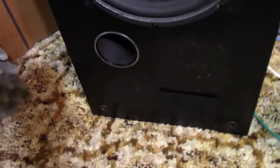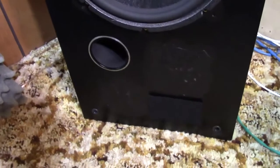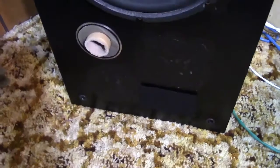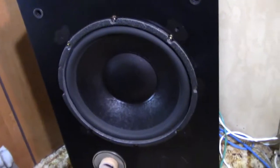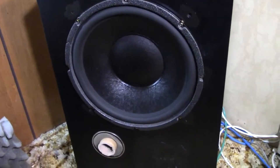You'll notice this little plug for the bass reflex — this is a bass reflex cabinet. I have the choice of either tuning it from the factory with the hole wide open, or I can put in a different tuning with this plug that has a smaller hole opening, or I could stick one of these in there and plug it up completely to make it acoustic suspension if I wanted to. I like to experiment with things.